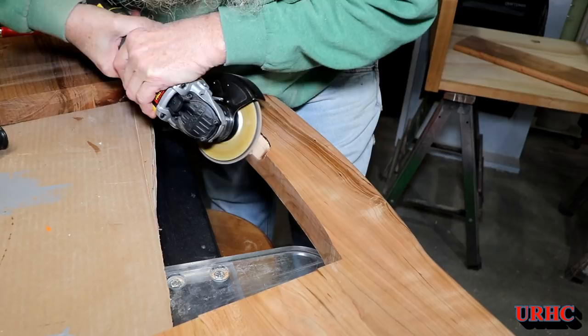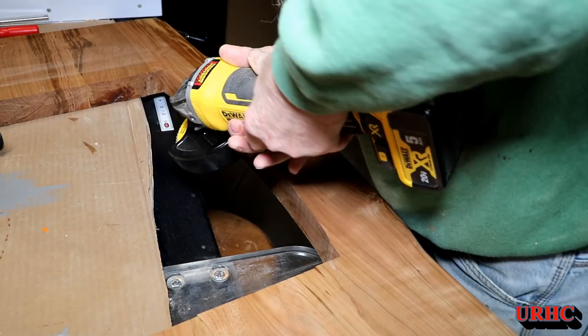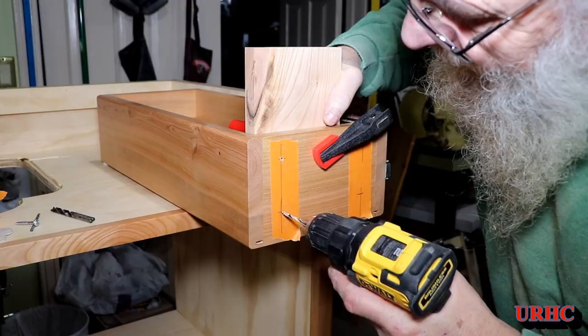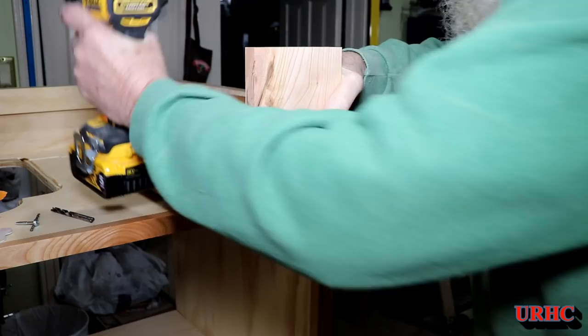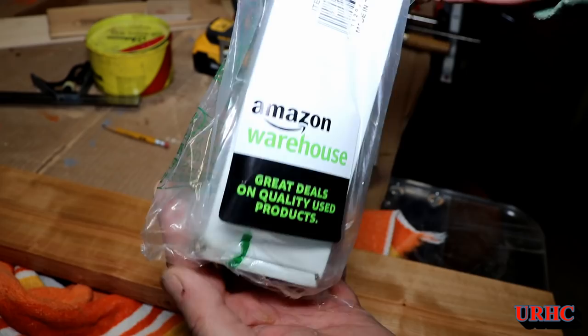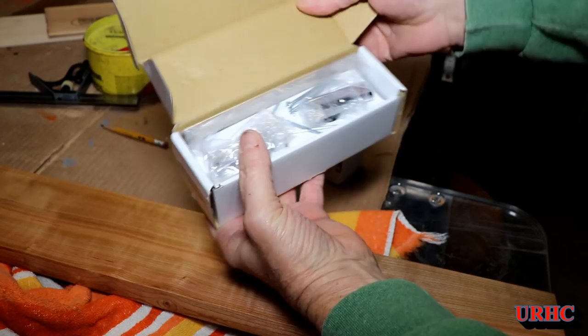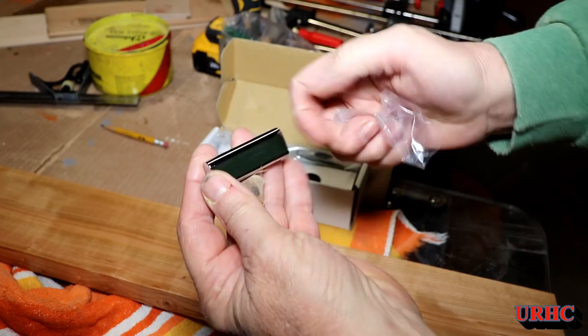Time to get ready to install stuff. When I set the sink to locate exactly where I wanted it, I found the ceramic had a little lump in the front that was getting in the way, so I took my angle grinder with a 40-grit flap wheel and cleaned it up. Then it's time to put that front piece on for the drawers. I figured I'd screw it on from the back with some Kreg screws, so I drilled some clearance holes. I also couldn't find handles for a long time, but in the end I found that Amazon's warehouse section had the exact same hooks that match all the fixtures in our bathroom.